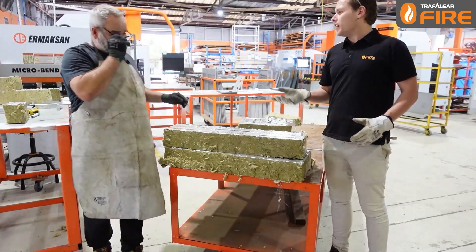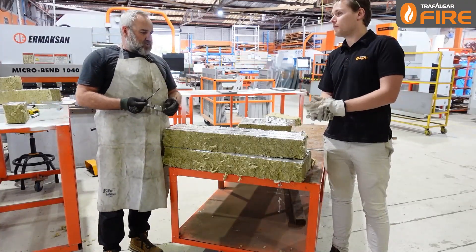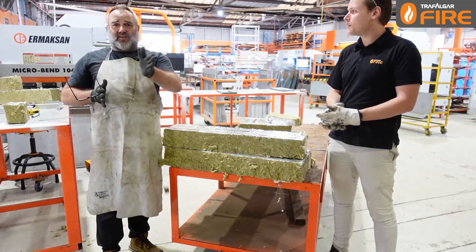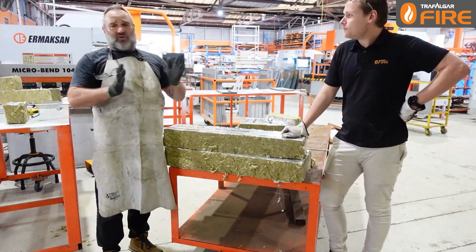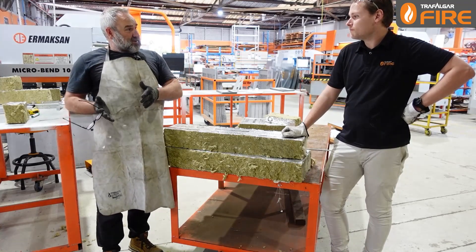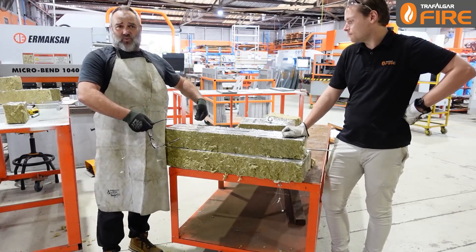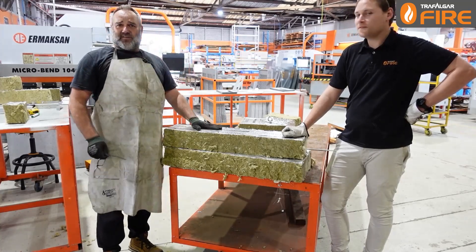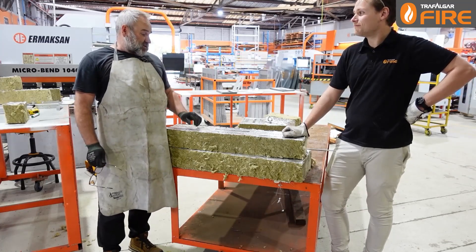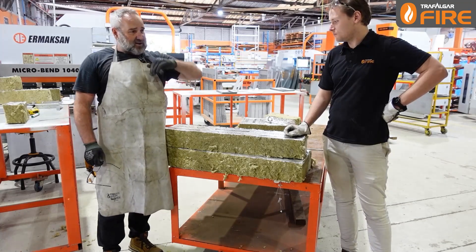So John, why wouldn't you get this pre-cut up at Trafalgar's woodshop? You can get it pre-cut, but what we're finding over the last 12 months of selling it is that the slab varies a little bit — there are tolerances in the curtain wall, and if it's cut too small it's pretty hard to extend it. So it's pretty easy to take the boards, measure each one, quick bread knife cut — it's not hard to cut. That's probably my preference as a contractor: do it on site, make sure it's compressed in nice and tight around the entire perimeter, the way it's been fire-tested.